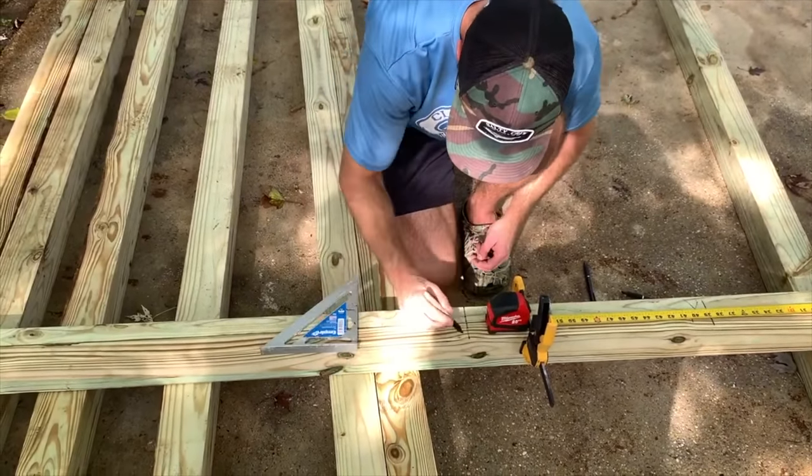After applying your slick coat, you're gonna apply your accent epoxy. In this case, this is the darker metallic epoxy, and we're gonna apply this in small puddles or ribbons across the floor. So continue to apply the accent color. In our case, this is the metallic silver, and I recommend that you continue to pour small ribbons and don't overdo it. Less is more to start, and you can always add more later.